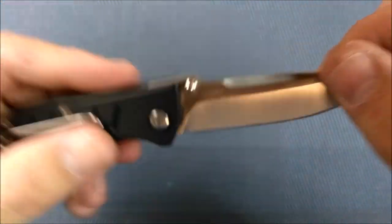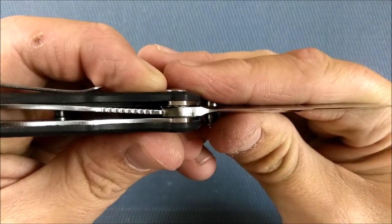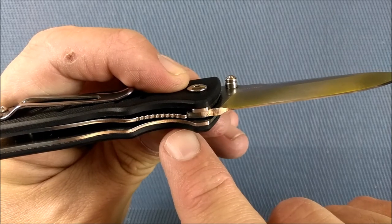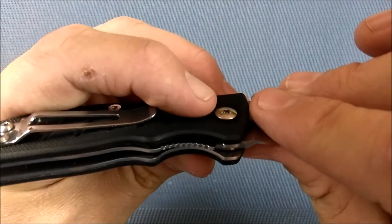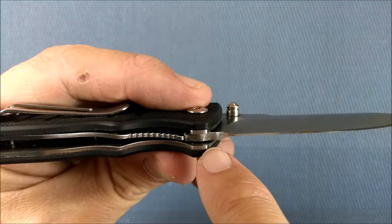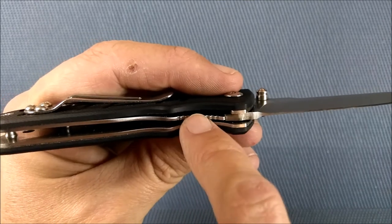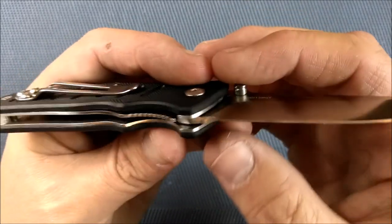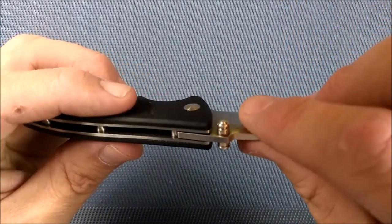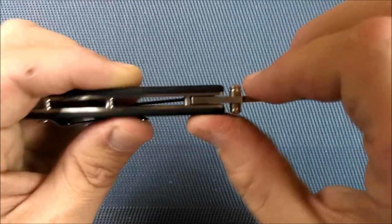You can see how well everything lines up — no blade play, side to side, up and down. Lockup is a little later than I like for a brand new knife, but it's not bad. This knife is still going to last a number of years. If I look closely, the center of the lock arm is not at the center of the blade yet, so there's still room for the liner lock to wear over and give it some more life. There's a white nylon washer on this side of the blade and a phosphor bronze washer on the other side.